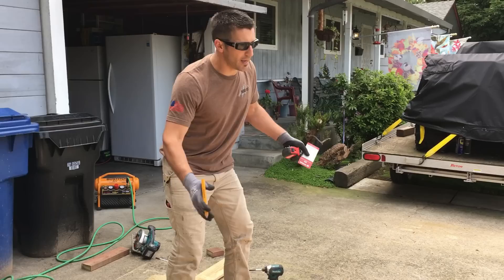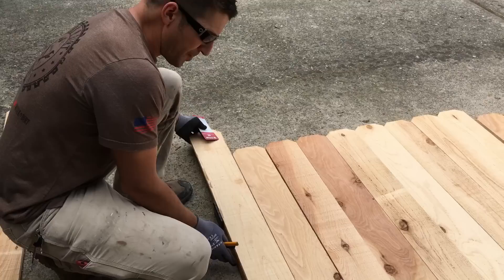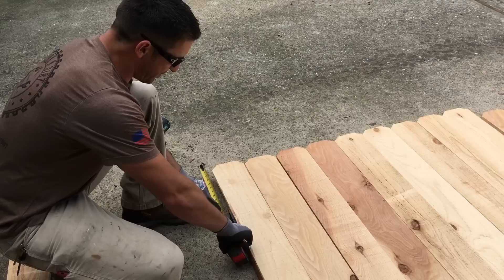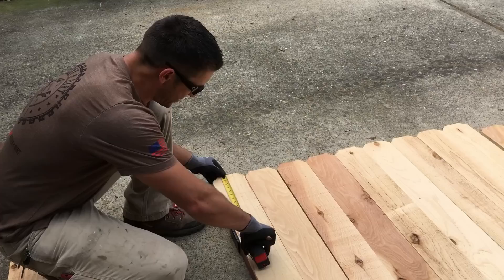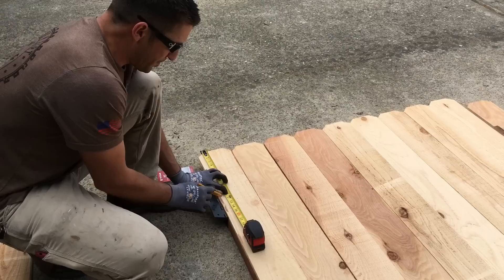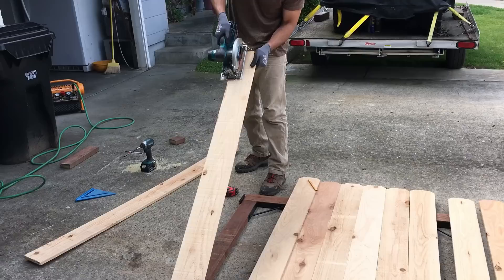The next thing is where to set your gate and where to nail your boards. I measured from the top of the fence picket on the existing fence down 11 and a half inches, which is where the old post is on the old fence. I made a mark at 11 and a half inches so that when I go to screw my hinge in, I'm below the post and can screw into the post on the existing fence. Now I know where to place my pickets because I'm referencing the top of the existing fence.